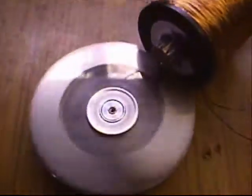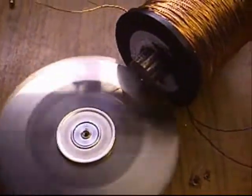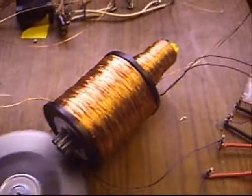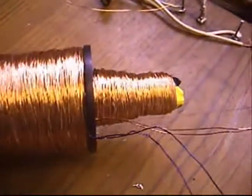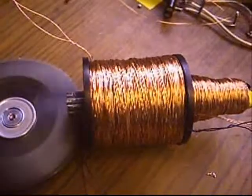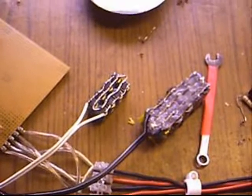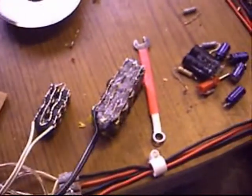First of all, just an update - number 7 I think - as to where I'm up to. Let's take a look. As you can see from the coil, it's now got a generator coil on the back, which is wound directly onto the core. And there's a generator over the top of the bifiler. The additional capacity bank there adds 4,800 UF to the 17,700 UF that's already there.